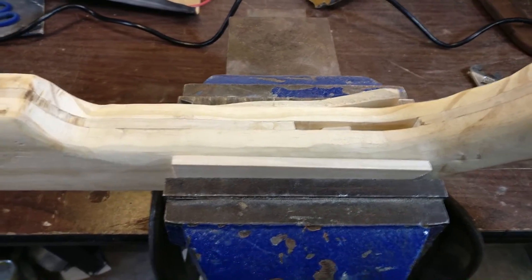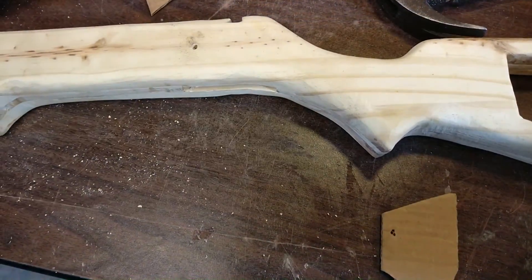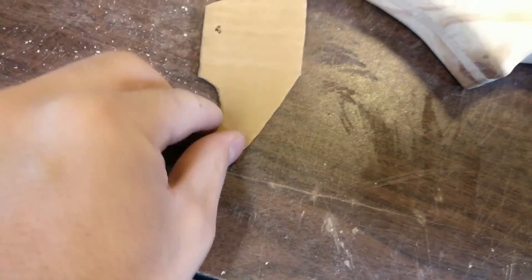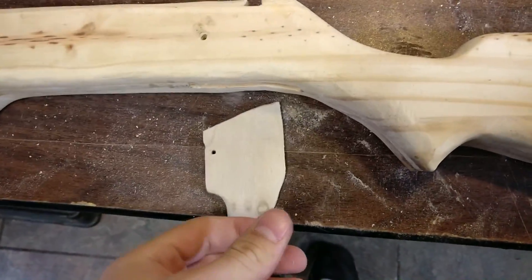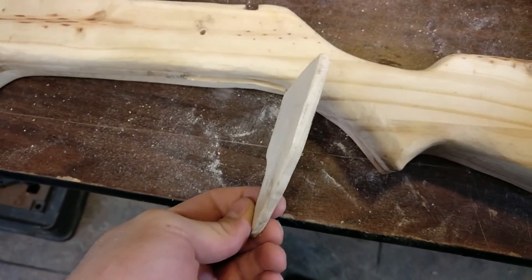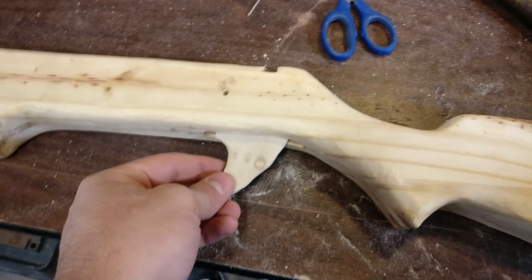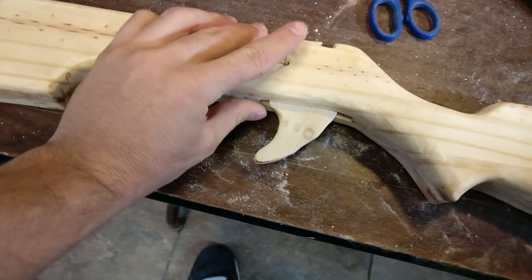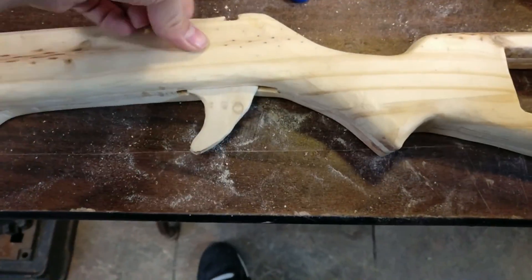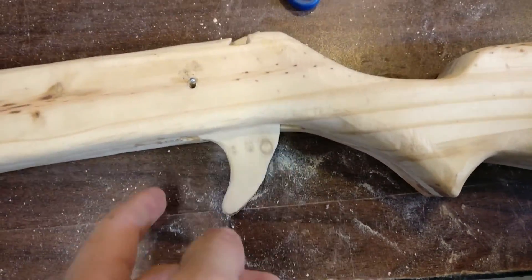Unfortunately, a minor setback has occurred — our trigger has broken cleanly right off of where it's supposed to be. But I believe I can fix that. I've basically drawn up a beefier trigger, which is going to do the same thing except it's going to be a lot thicker at the point where it broke last time. I've finished cutting out this trigger shape and sanded it down width-wise so it slips in and out really easily. Basically just line up the holes, take a pin, drop it in to its place. There you go — now it's a working trigger.